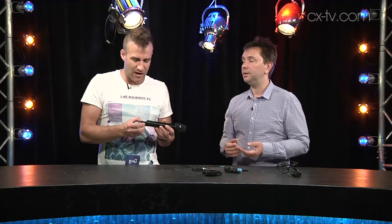You get up to about 30 meters of range line-of-sight, and in practice you can get considerably more. The cool thing about the transmission on this is that it's a two-way thing between the transmitter and the receiver. It constantly monitors the signal-to-noise ratio, and if it's getting a bit noisy it'll tell the transmitter to bump its output power up.